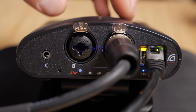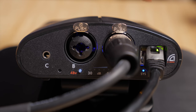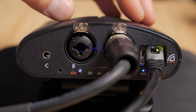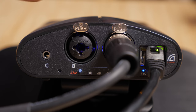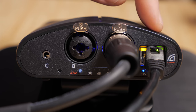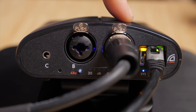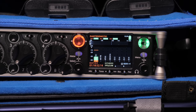The matrix takes the audio from this microphone — it has a preamplifier with phantom power — converts it to digital using a very high quality analog-to-digital converter, and sends that audio out onto the Dante network. We have this set up as a transmitter for input A. I've actually routed that over to my Sound Devices 888, which you can see is recording us right now. I've set the Sound Devices 888 up as a receiver for the audio from the matrix.